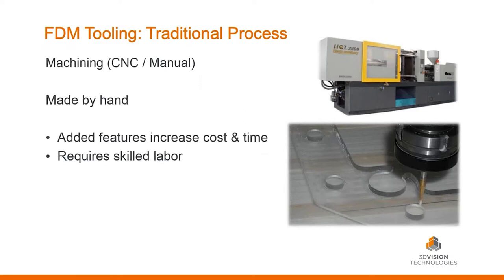All of those parts get out to the assembly area where they're assembled and either installed on a robot for its final use — in the case of end-of-arm tooling — or going somewhere else for soluble cores. Traditionally, soluble cores are a clamshell design where you have a shape hollowed out, you lay in the carbon fiber, set it, and bolt it together, so there's always a seam to worry about.